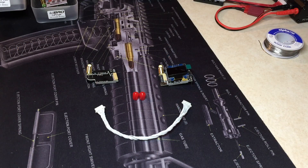To give you some of the advertised specifications: this module allows you to save channel and start up with the last saved channel in settings. The screensaver displays current channel, call sign, and signal strength. The settings menu allows you to calibrate RSSI, set call sign, frequency, order, and save. You can quick save by holding select for 2 seconds in manual mode and search mode.